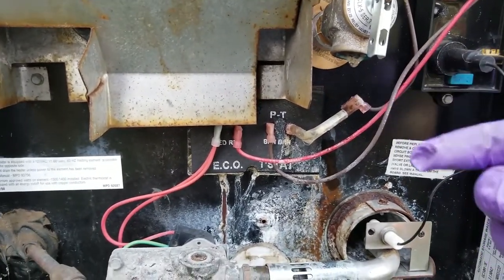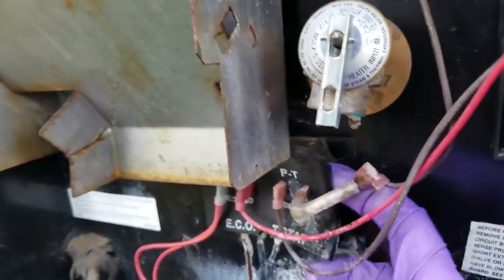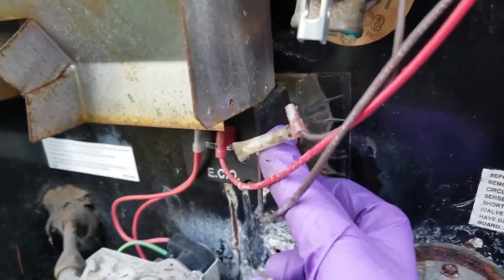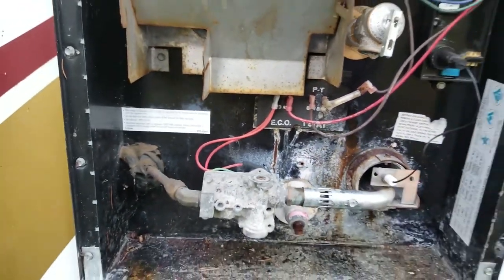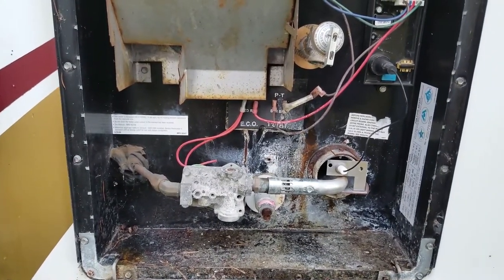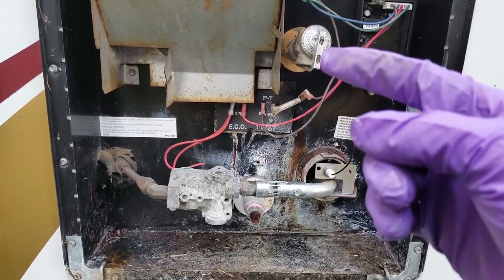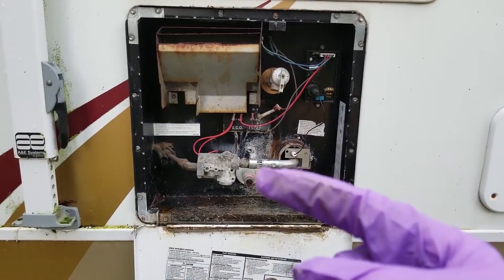It was continuously running. So when we see this, another thing is this sticker thing is not bonded, and back behind here you have the thermostat, and the thermostat could rust. The tank is going to be fine, we expect, at this point, because the tank is an aluminum tank. But all these components are showing signs of this dripping right here. So the first thing we're going to do is start with back flushing the water heater, and we'll show you how we do that.